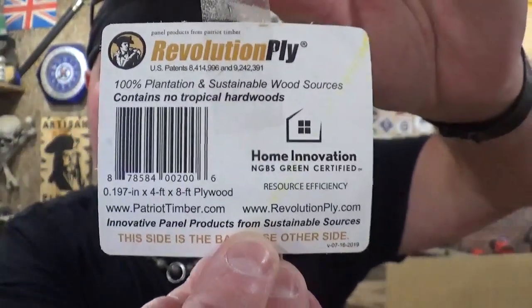There you see it — four foot by eight foot sections. The only thing about this plywood is it is not a true one quarter inch material thickness. It's just shy of a true quarter inch, so if you're going to use a tab design like I used earlier in the month on the pumpkin candy dish, you just have to go back and re-measure. I always keep a scrap piece of this by the scroll saw so I can lay it down and mark it to get the correct slot thicknesses.